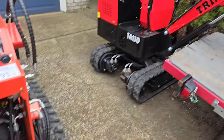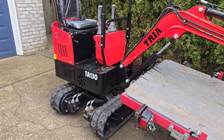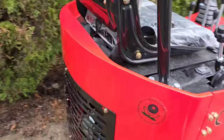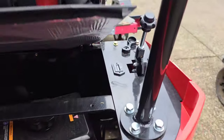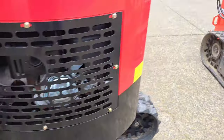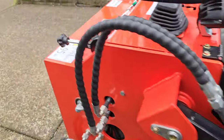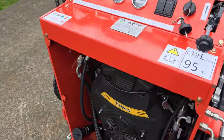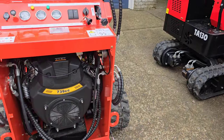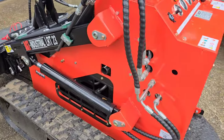The motor on this — just for specs on these little mini excavators, these one-tons — I think it's a 420cc motor. The motor in this machine is basically double the size of that excavator's motor, and that excavator has plenty of power. The reason is this has two pumps instead of one — one pump versus two attached to the motor — so a lot more performance, but you also have a lot more demand on the hydraulic system.